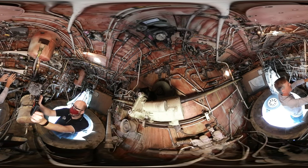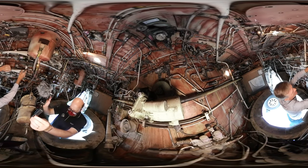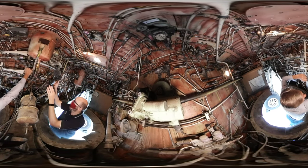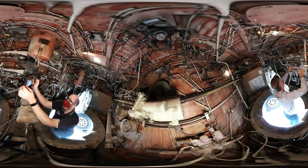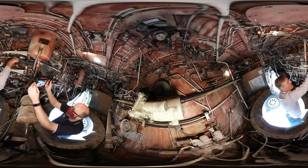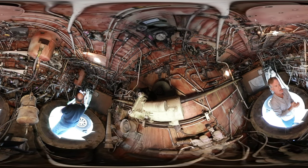The PCU then uses its hydraulic power to throw the crank and move this shaft here — this is the aileron control column. On it we've got these two quadrants, and these quadrants actually hold the cables that go out to the ailerons. You can see there's a terminator there for this cable, and the cable comes along, goes out around the pulley, and off up to the left-hand wing — so that's your left aileron linkage there. And the right aileron is the same above it: you've got a terminator on the cable, the cable comes around the quadrant, then goes across, around the pulley, and up the wing to the right-hand aileron.